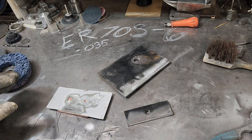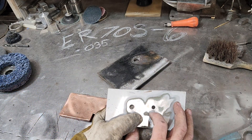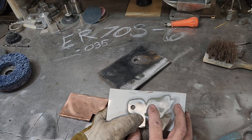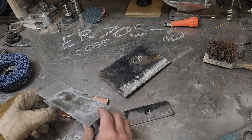When it comes to welding on the copper, you don't necessarily want to put the heat to the material — put it right into the dead center of the hole or even close to the edge. It's going to fill in this hole. Don't try to weld to your surface itself; we'll get that hole filled.